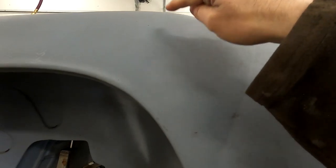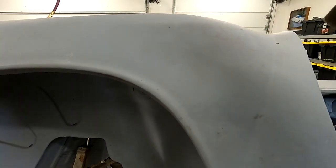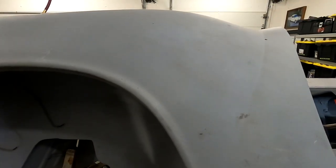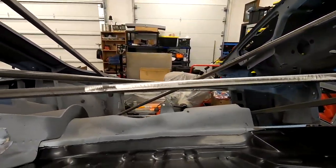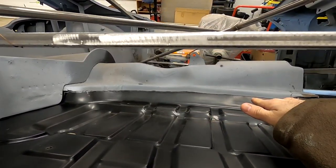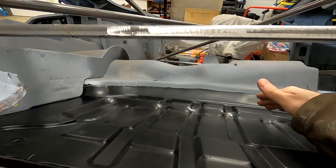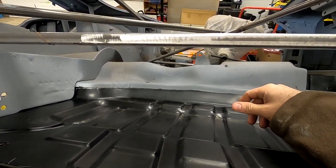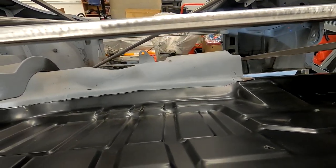And there was a YouTube video I watched, and I shared it on MeWe of all places. I'll have to post a link to it on this channel, but it was an interesting way of putting a panel on a body. It was doing a gas filler door on a straight panel. The person who did it, and I apologize, I don't remember the name, I'll put it on the video, used a really interesting tactic: putting the piece over it, tack welding it in place, and then coming along with your cutting wheel, cutting it at an angle to end up with a really tight butt weld. As you cut, you go around doing the welds, and the piece in the back basically pulls off, and you end up with a nice clean butt weld.